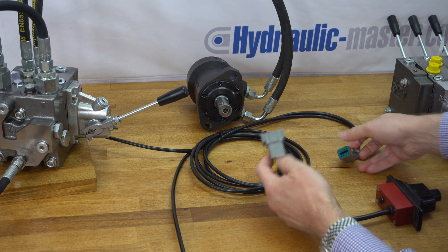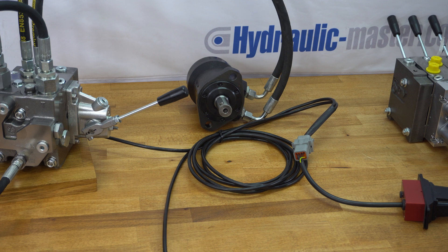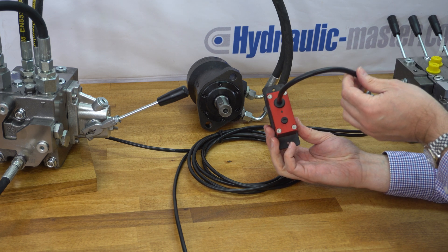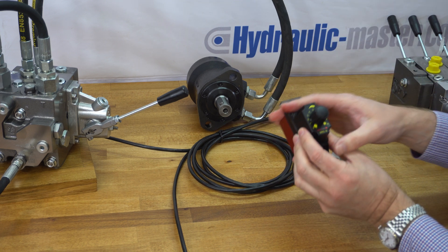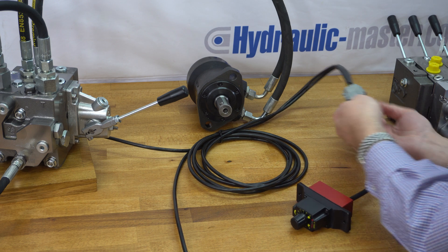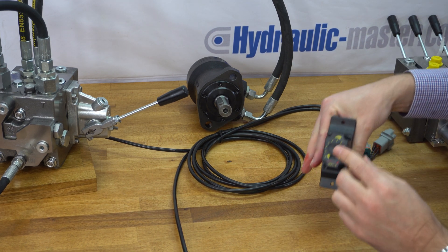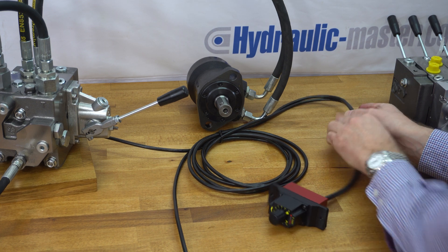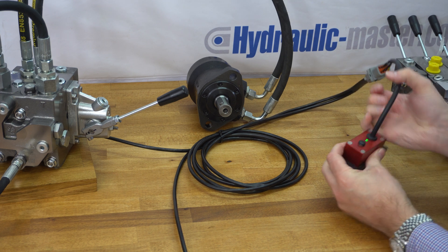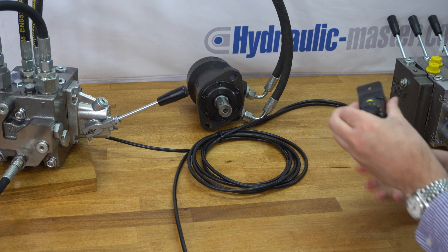Number four. Power's still off — reconnecting. Power back on. This is what I wanted to show you: we have the red light. The fact that we've got the red light means I haven't done something correctly. If we look — the switch is not in the neutral or zero position. I'll turn the power off, disconnect, put the switch into zero, reconnect, and put the power back on. And this time we have the green light. The green light is obviously what we should have.